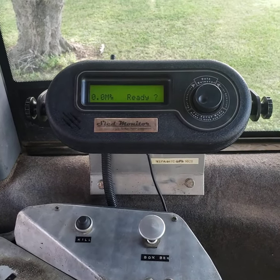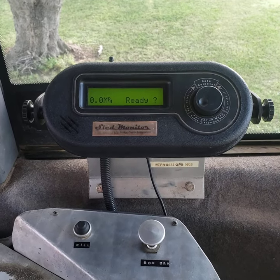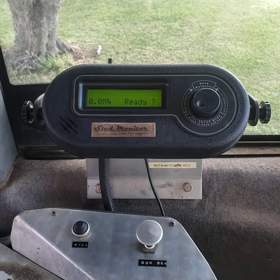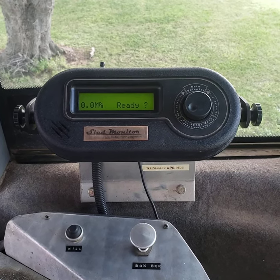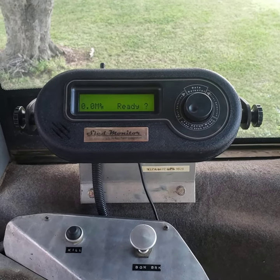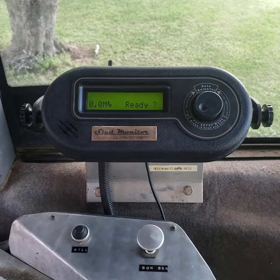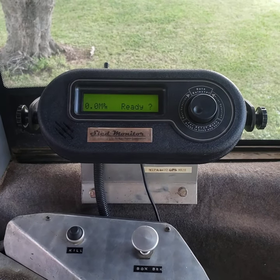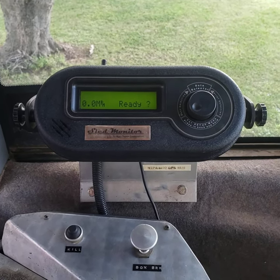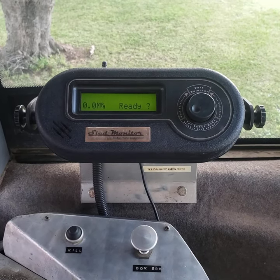Here's the Agritronics box for onboard measuring. I only have a GPS on this sled — I do not have the gear tooth to count off the wheels, because most of the time with bigger stuff even with four weights in the box, we stop and all eight tires are up in the air spinning. So we may come to a dead stop and it's still counting, so I don't have that — I've just got the GPS. At PPL events, NTPA events, whatever it may be, obviously we use the laser for a little more accuracy.